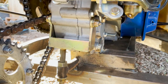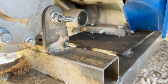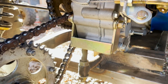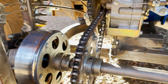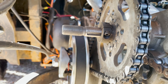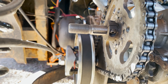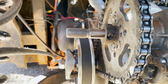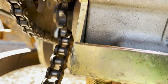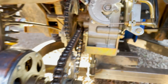Just a quick look at the bracketry — it's very simple, just bolt the brackets on, then weld everything down. The back bracket is just for adjusting chain tension. I didn't put a nut or spacers on that sprocket — just a clamping collar, that's all you need. The keyway shaft does not go all the way through, so any sprocket with an integral key built onto it will not work for this reverse kit. Same thing applies to the sprocket on the inside — you cannot use an integral-keyed sprocket.